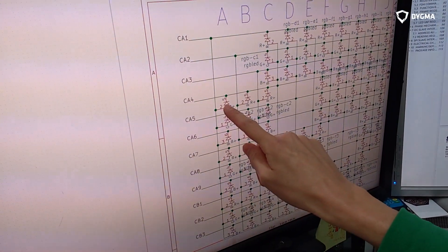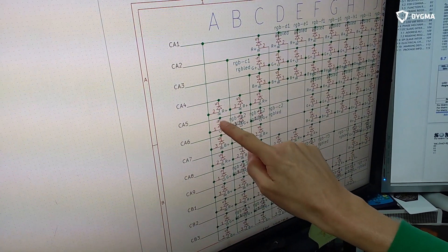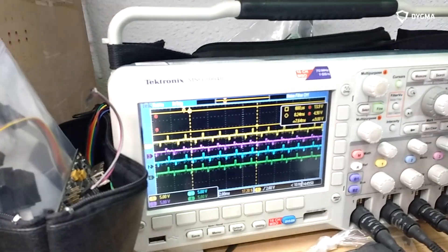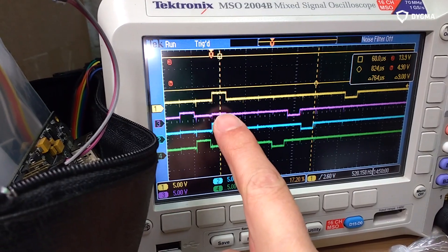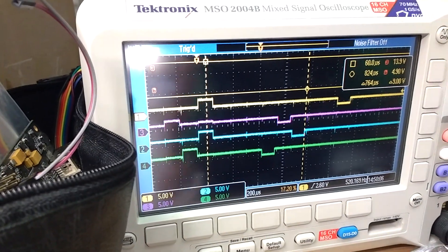With this complicated wiring, if you want to turn on the red one, this line here has to go high and this one has to go low. But because this line is high, these ones will also be trying to be on. So the driver has to keep these two lines high as well. Depending on how high the voltage is, depends on whether the LED is off or maybe on a little bit. I wired up these four little wires and connected them to the scope so you can see the four different voltages.